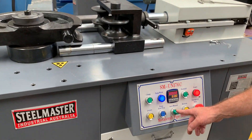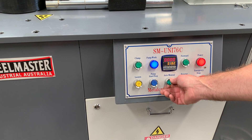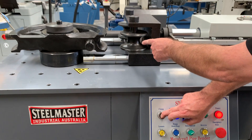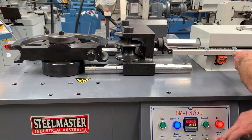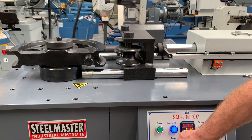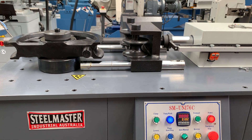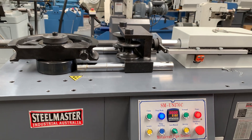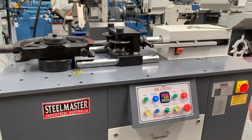We've got manual and automatic mode. Currently we'll switch that to manual mode just to show you — we can have full clamp position here, as you can see there. And it can reach the limit switch over there and then bring it back to its start position. We'll put this to automatic. So we've got that set to a 180-degree bend and we'll run through that cycle later.